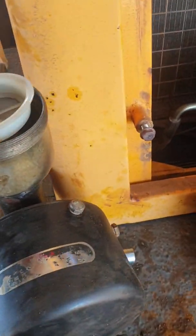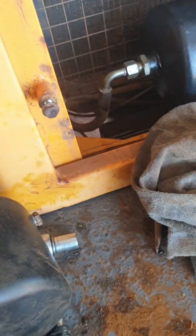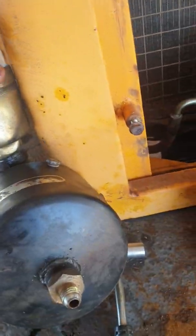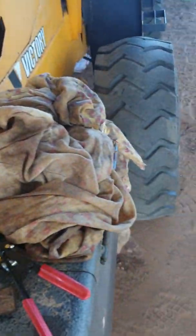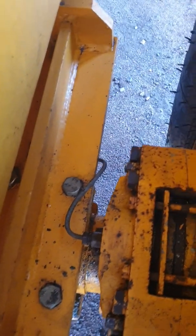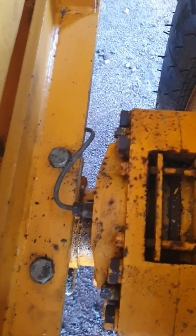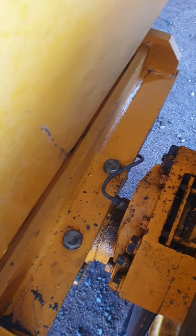Probably advisable, once you're doing this — I don't know what yours would be like, but my brake fluid was pretty feral. It was coming out like mud. So what I did while I had the line off on this rear one, I just put an air line through there, backed off the bleeders on the calipers, and pushed it through until it stopped draining out. Now, mine does not have nipples, so you can't use vacuum pumps or anything like that. The way I decided to get these ones bled was to actually gravity feed the oil down — just let the oil drain down by gravity until it stops glubbing and you get a nice flow of oil coming out, then lock them up. Same on the other side.